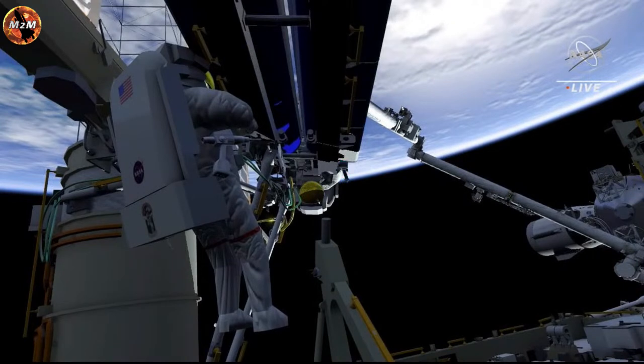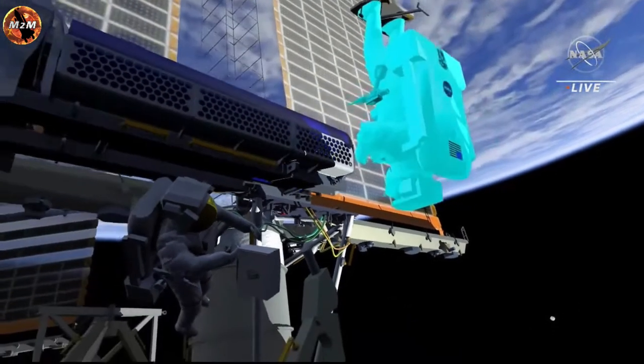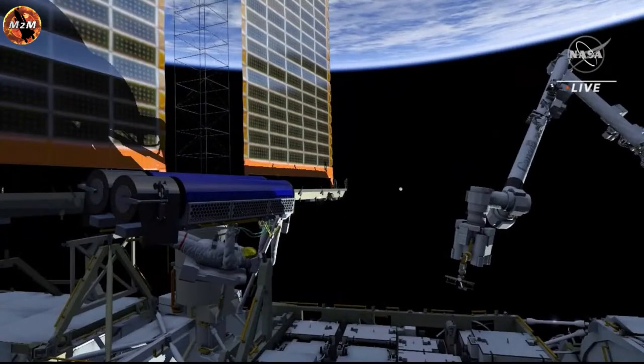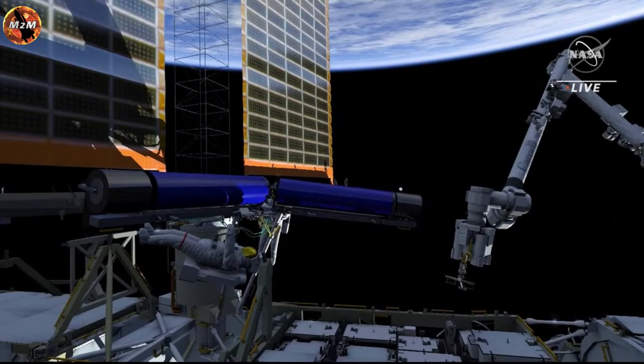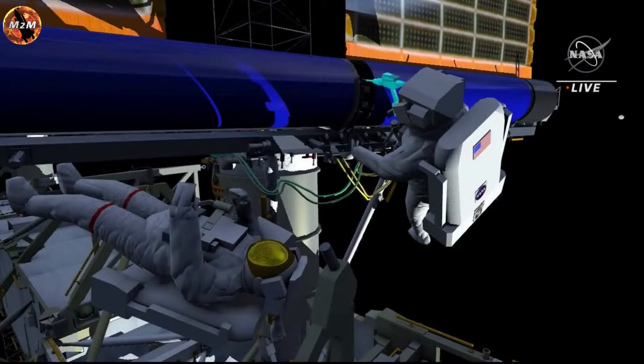The crew will release the scoops, and EV2 will move into position to release the final bolt holding IROSA in its folded position. Once released, EV1 will hold IROSA closed while EV2 egresses his foot restraint and gets into position. Both crew will then work together to unfold IROSA and secure the right side onto the mounting bracket. Once secured, EV2 will drive two hinge bolts that hold IROSA in the unfolded position.